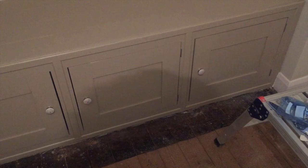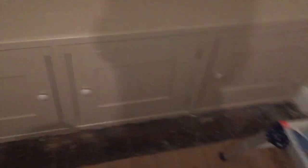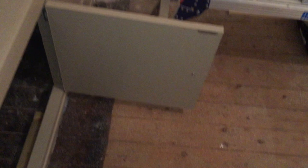So I'm just going to show you how we did the hinges. The hinges are all the same on every door. The way I did it was I measured about seven centimetres from the top to start the hinge, and the same from the bottom to start the hinge again on each door. That meant they are all the same across the full front. Then, as we needed to hang them on the support beam, I had the door open with the hinges attached to the door, put a bit of support wood underneath the door so it sat in position, then marked where the hinges would need to be placed inside the support beam. Then I screwed the pilot holes and attached the hinges, making sure there's about a couple of millimetres gap at the bottom and the top.